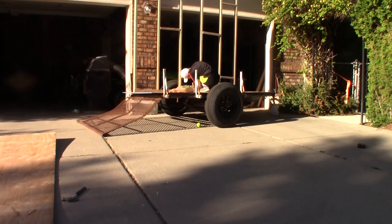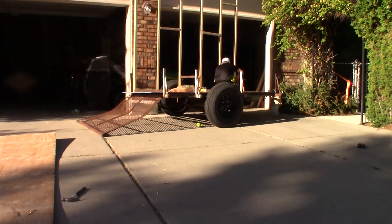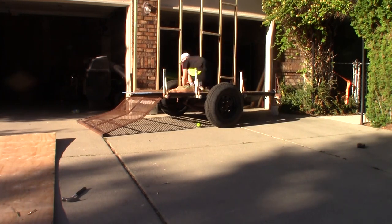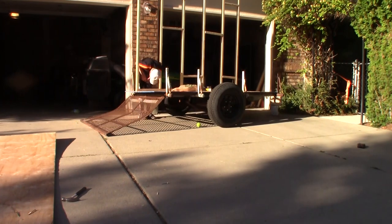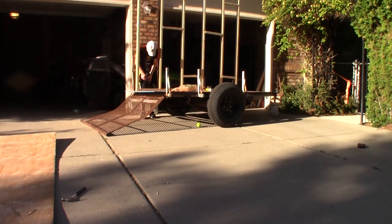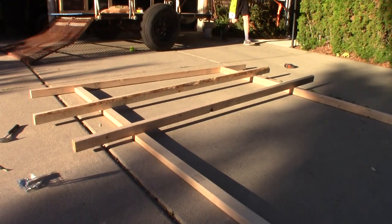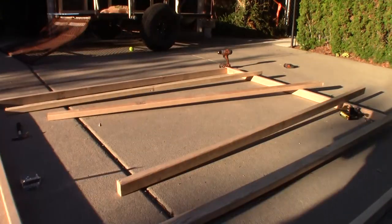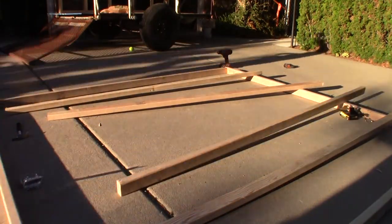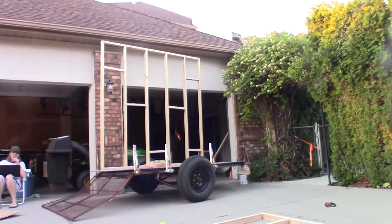So I just finished screwing some in. In a few seconds here, you'll see me making the front frame. This is a hard one because I had to frame a window in, but I figured out how to do it. I laid every 18 inches, spread the pieces, and made horizontal pieces. And that is the window frame as you saw right there.